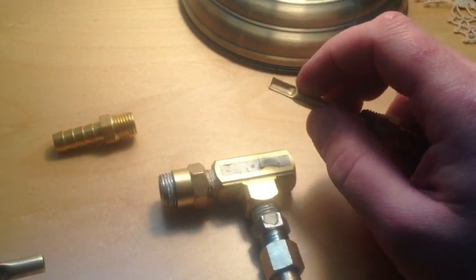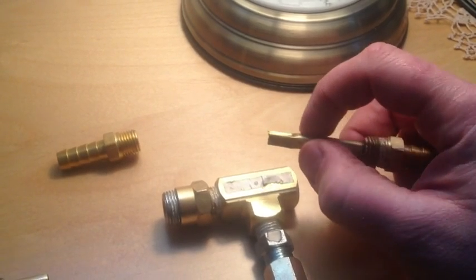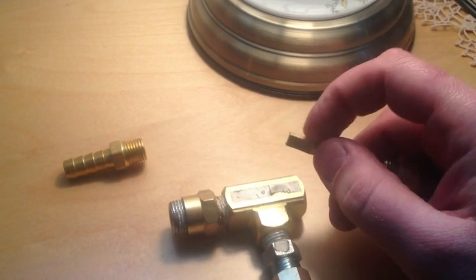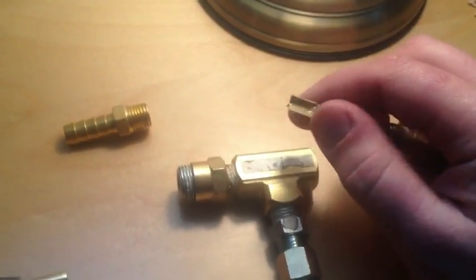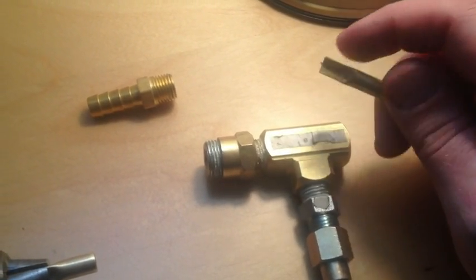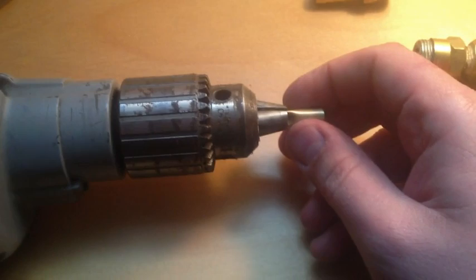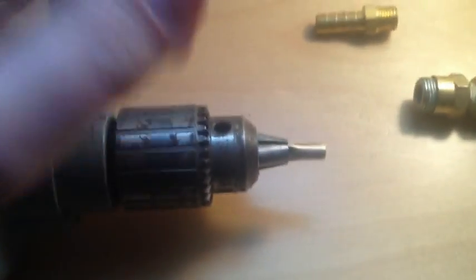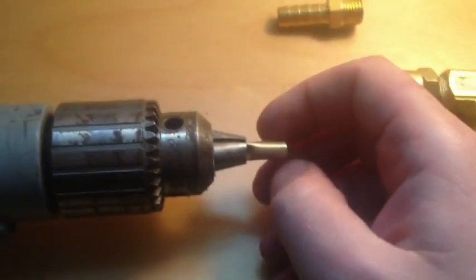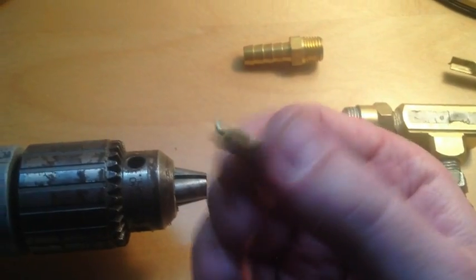A gentleman named Gary Packham from the UK told me about crimping the tube. The reason I did this was so that when the air passes through, it follows through the nicks and crannies and comes out of the nozzle at really high pressure, which makes the liquid fuel atomize with the air around it. Gary told me: just place this tubing inside a chuck from a drill. So I took the tube, put it in the drill chuck, and tightened it all the way until I couldn't anymore. Because the tube is really thin-walled, it's easy to crimp, and it makes it beautiful for atomizing fuel.